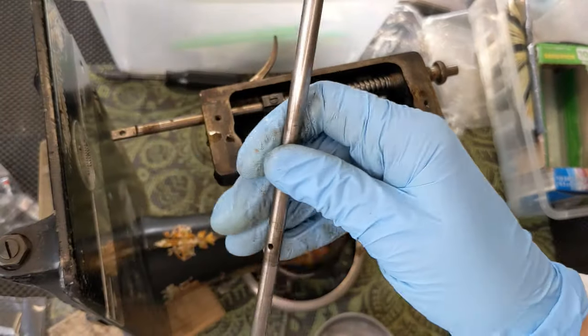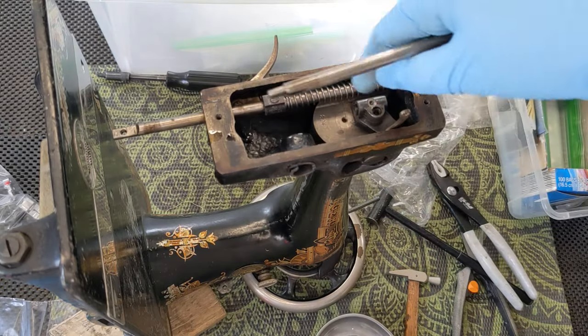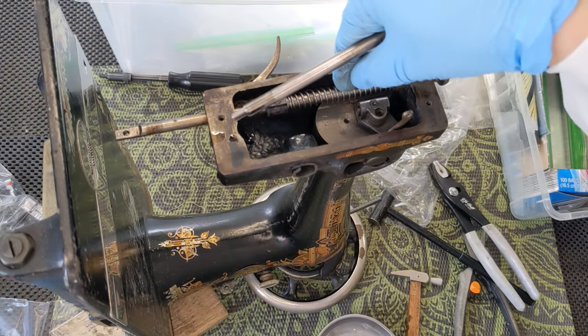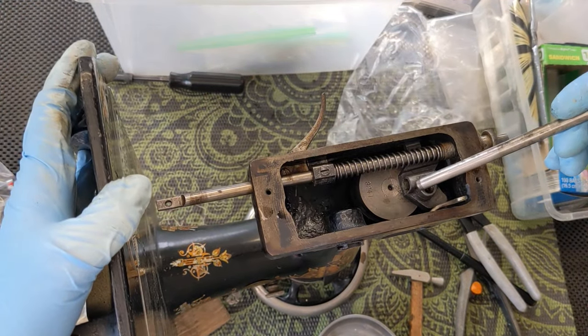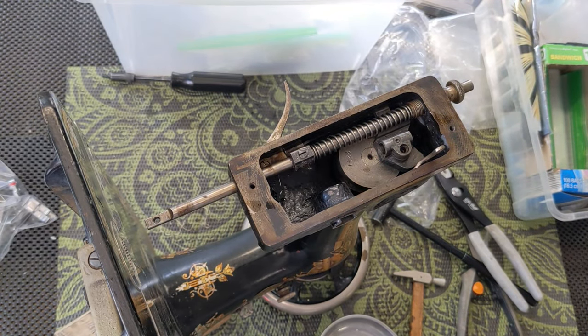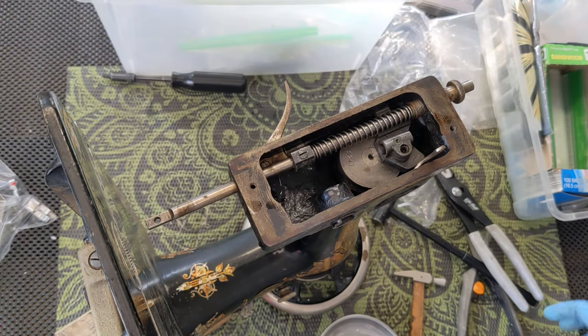So there it is, needle bar. And then we're gonna get started working on the presser bar. Even though this bracket is technically for the needle bar, I'm gonna keep it with the presser bar stuff because when I put it back together, that needs to go in before the presser bar. And if I don't keep it with the presser bar, I will do it in the reverse order and have to take everything apart and redo it. And I know this because that's happened to me several times. So,